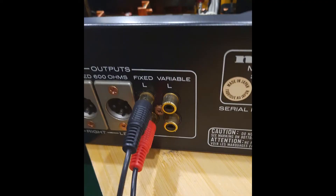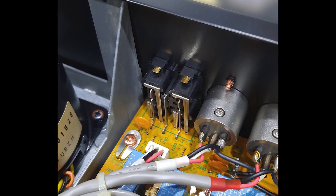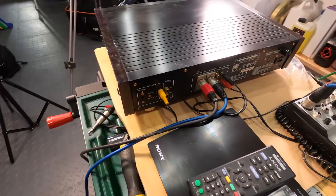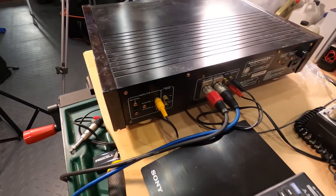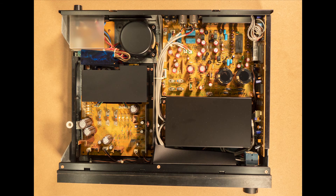The problem as described was noise and crackling from the output sockets. At first I couldn't get this to happen, but then I found that putting a bit of pressure vertically on the socket affected the connection. Looking inside I realised the sockets were PCB-mounted sealed units, unlike the more conventional screw-threaded RCA phono sockets. The solution turned out to be simple — with the passing of the years the screws holding the socket chassis and panels together had loosened, and there was a bit of play in the phono socket units against the back panel, allowing the socket connections to flex and introduce noise. By loosening, repositioning and re-tightening all the mounting screws, the movement was eliminated and all the noise and problems disappeared.